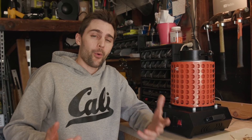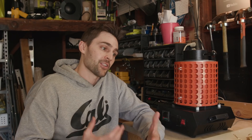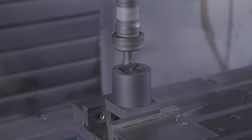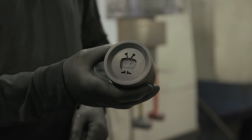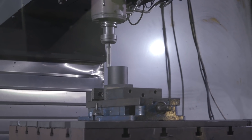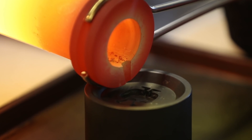Our gold is not actually pure gold — it's 10 karat gold, so it's right around 41.7% gold. However, the gold that we mined is probably closer to 24 karat, so we're still going to plug in the higher number to make sure all the material is completely melted. Because this entire experiment was inspired by TiVo Stream 4K, we're going to make our piece of gold jewelry in the shape of the TiVo logo. We had this graphite ingot custom made — CNC'd for us at Electro Tech Machining. Graphite gets stronger the hotter it gets, up to about 2,500 degrees Celsius, which is why it's the perfect material to pour molten gold into.